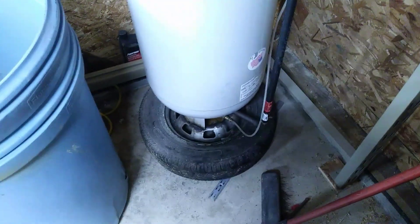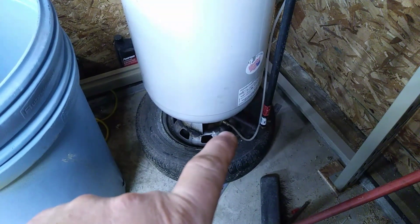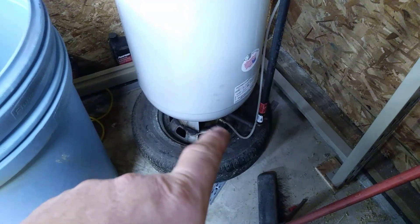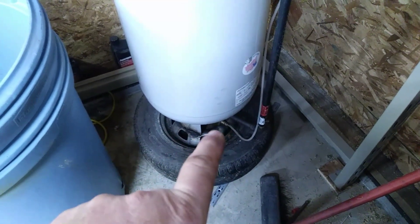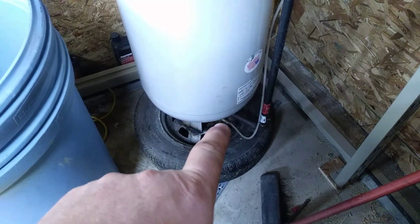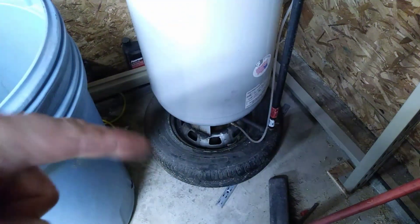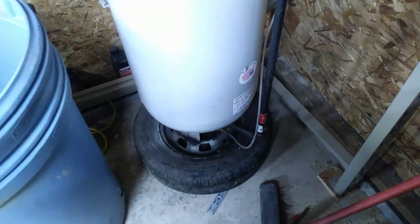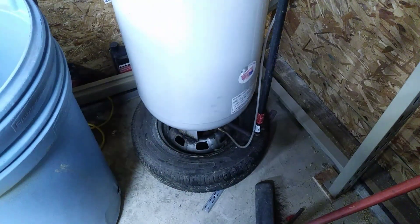Years ago when I first built this I put one of these automatic drains on it. Basically every time the heads decompress, it cycles a little valve and releases about a teaspoon of air or water — whatever is laying in the bottom of the tank. These work really well. I've read a lot of people complain about them but I have not had any issues with mine. I like it and I'm going to keep it. I'll put a link below. I highly suggest it so you don't have water just sitting in the bottom of your tank — because if you're like me, you'll forget to open the valve and let it drip out.